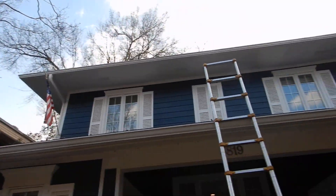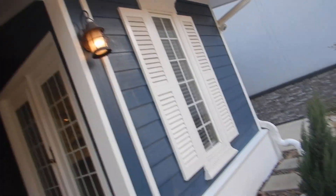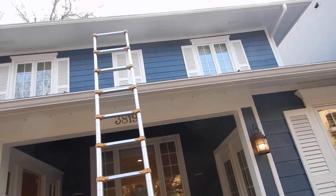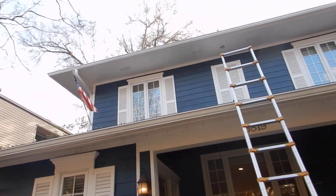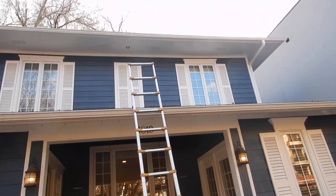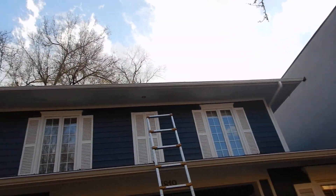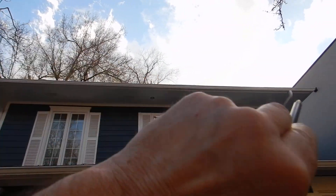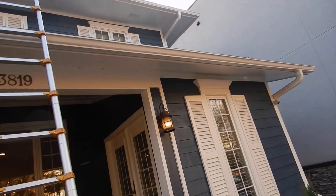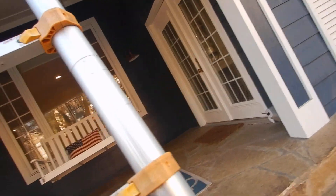There's going to be some more discussion on the roof section. When we see the attic it's going to answer some questions, and when you see the exterior wall it's going to answer some questions. Right up here you have four soffit vents, and we have a continuous soffit vent on the back. So this attic does have air intake, and we wanted that.